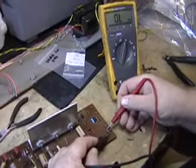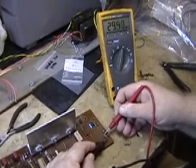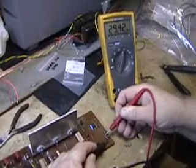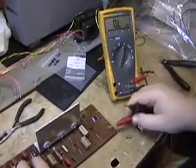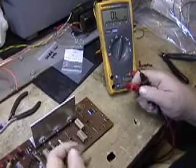This one here is supposed to be 22 megaohms. It's no longer made, and it's now reading 29 megaohms. So we're going to replace this one with two 10s, and this other one is the 8.2 — you can still get the 8.2.